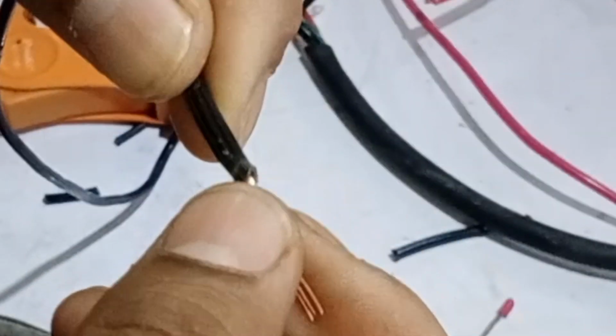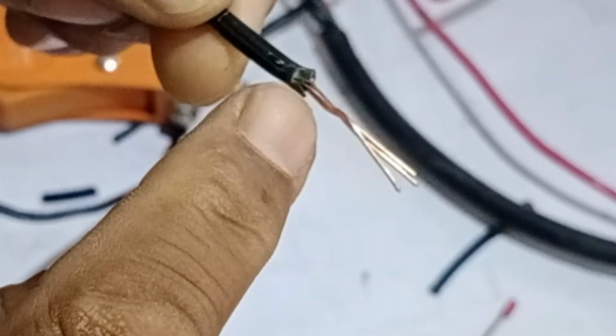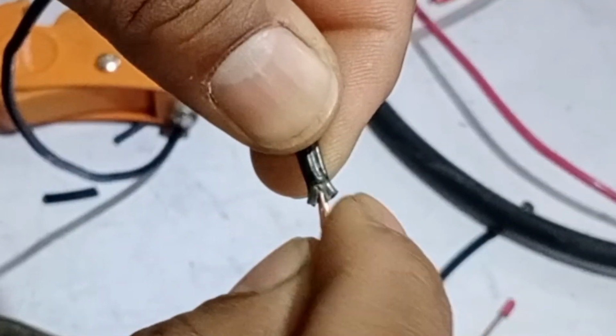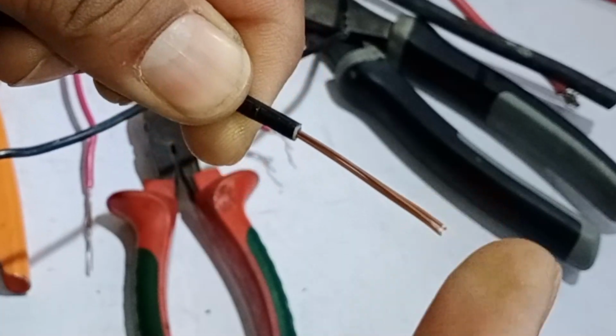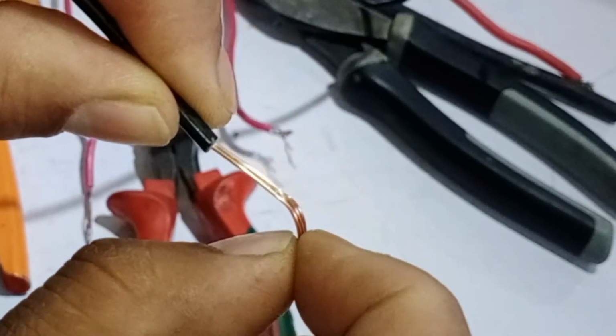While you can technically strip wires with various tools, the real concern is damage to the wire itself. If the wire core gets nicked or cut, it becomes weak. Later, when you connect that damaged wire to another wire or terminal, it's far more likely to break under stress. That's why ensuring the wire's core remains undamaged is crucial for a strong and long-lasting connection.